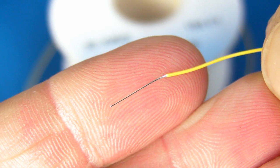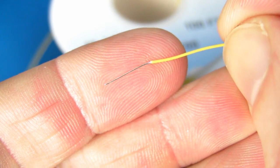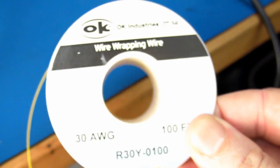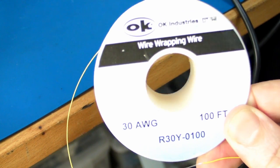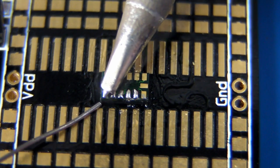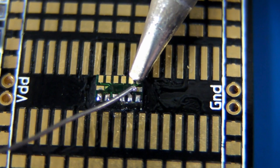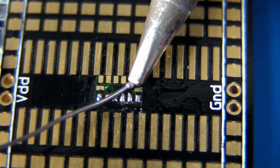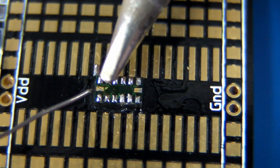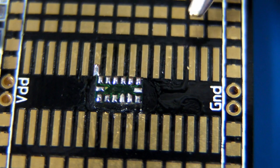What I'm going to use to make the connections is some wire wrapping wire — solid core 30 AWG tinned wire. This is really useful stuff; I highly recommend you get some. It's quite fine, great for doing mods like this. It's called Mod Wire, it comes in various colours, and it's an OK Industries brand. Using my chisel point iron and 0.46mm solder, I'm going to tin these pads. I've already tinned a couple. And then we will solder the wires — each individual bond wire onto those pads — and take them out to the individual connection points.